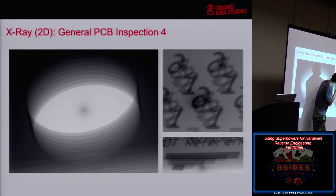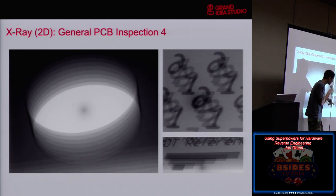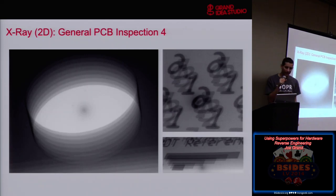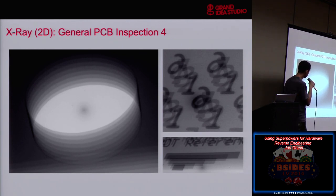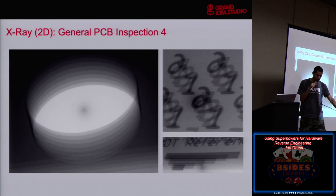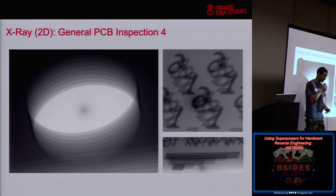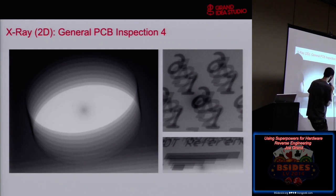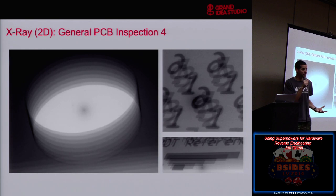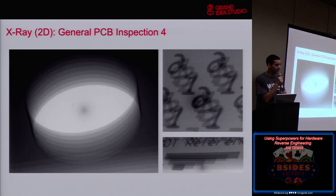Here are the layer numbers — one through six, sort of stacked on top of each other. We angled the field of view so you can kind of see them. From a hacking point of view, we can use stacking stairs to figure out how many layers there are and interlayer thickness. Because you can actually take measurements at this point and figure out lengths of things. Examining through epoxy is another great use of 2D X-ray. If you encounter a board and you don't know how many layers it is, you could look at a hole or the edge of the board and see individual copper planes — like doing a cross-section but non-destructively. If you only have one board, you don't want to chop it in half to see the layers — you can do it with X-ray.